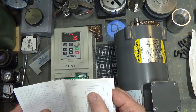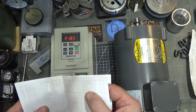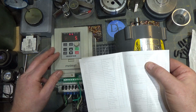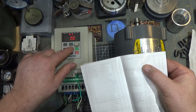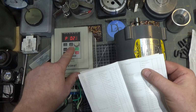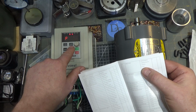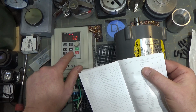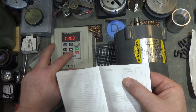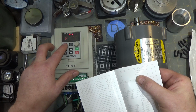So you go to program, it's in frequency. You could actually have operating frequency, revolution, current, temperature, and time. Current might be interesting. Let's see, that's setting P62 program. Now we got to get up to 62. Here's another one of these things where it would be nice if this was a little bit faster, or you could somehow speed it up, or go backwards from 0 goes to the largest value, etc. So let's see, it's currently set to 1. Let's go to current. So this is a 3/4 horsepower motor.